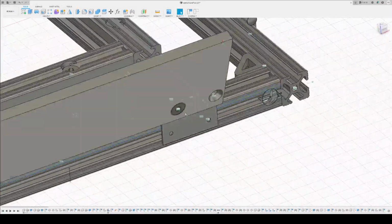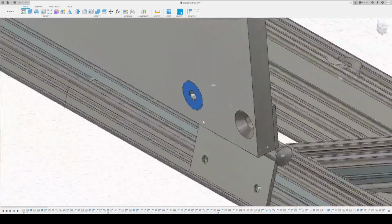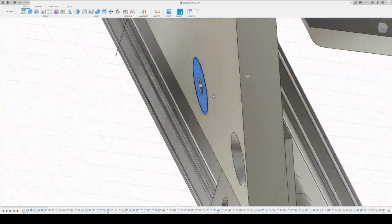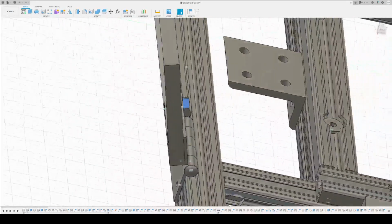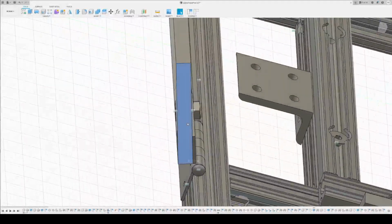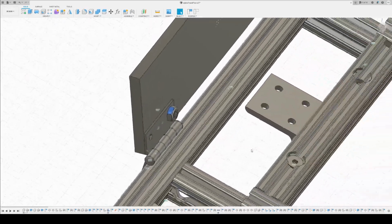I've got one of the modeled here. This is a 82-degree flathead screw. There's a bit of interference you see here in the CAD. I actually drilled it down slightly more in real life just to get it nice and subflush. And then there's this low-profile nylock nut on the far side. So basically it goes flathead screw in a countersink, looks like this, through the acrylic, through one side of the hinge, then directly into this nylock nut.